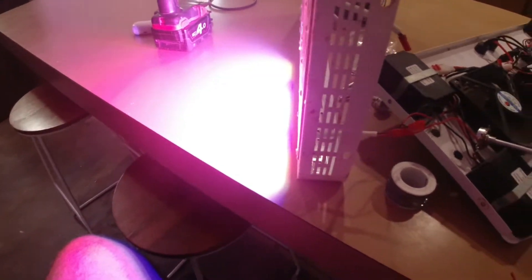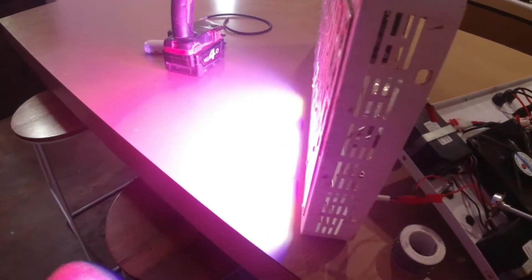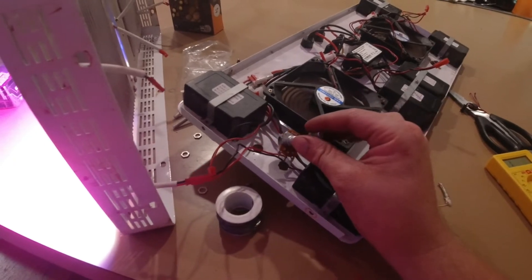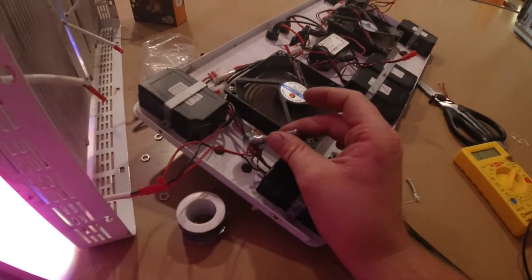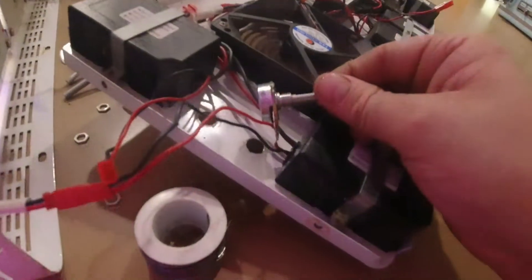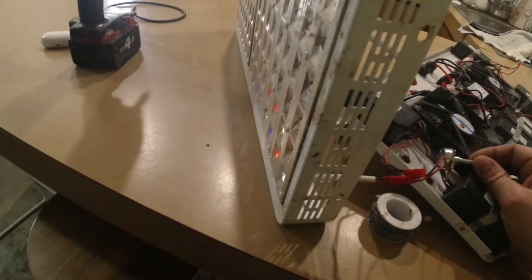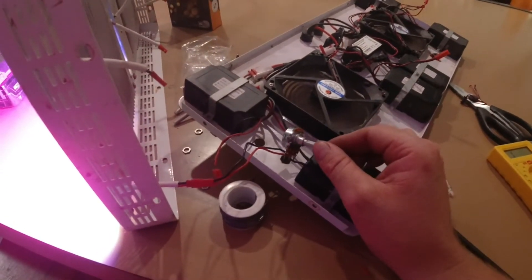Alright guys, so this is an epic fail — it only cost me about fourteen dollars but it didn't work. I need to do more research about variable resistors because the one I went with has too high a resistance. It worked at first, and I turned it down a little bit — just about three degrees of a turn — and it was dimming like 50%, then it smoked and actually melted the coil inside the switch, so it's pretty much just on/off now. But I've learned it's definitely going to work, so I can find the correct variable resistor and we should be good.